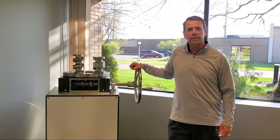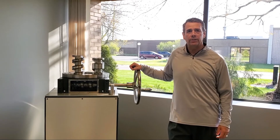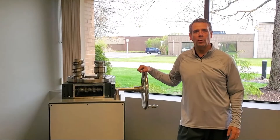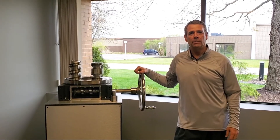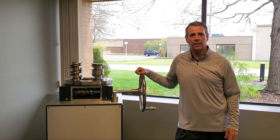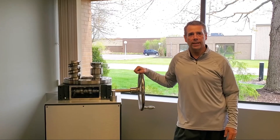We supply the TMF Series Indexer with a high-precision minimum backlash gear reducer with an input flange to accommodate any servo motor or AC motor with encoder. Through the zero backlash condition in our indexer and the high-precision minimum backlash gear reducer that we use, we can achieve low single-digit arc seconds of accuracy — the best in the market today.